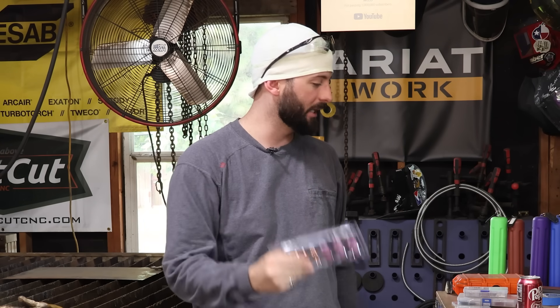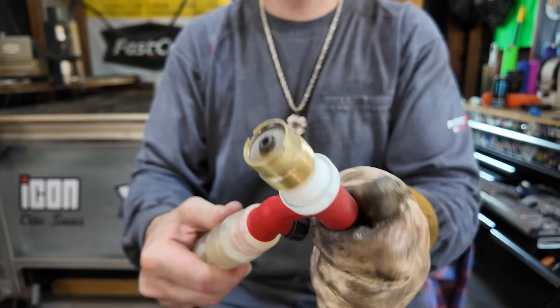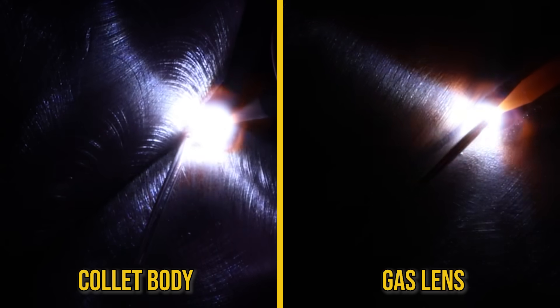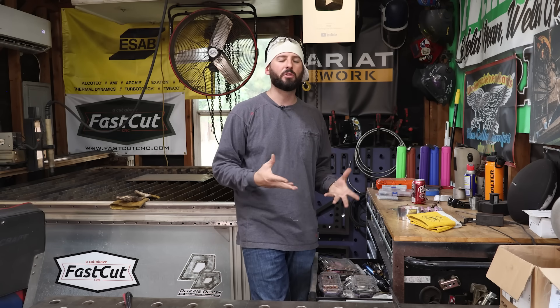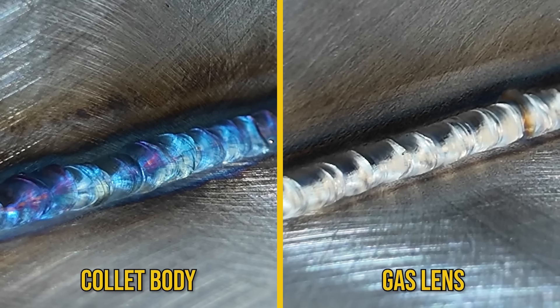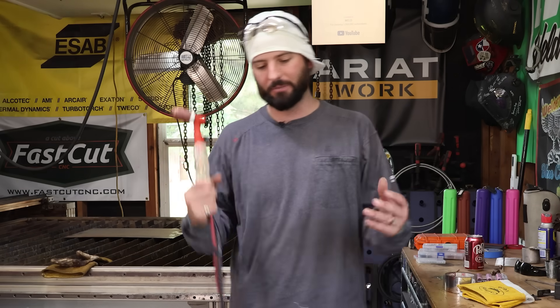You can be a good welder with just the basic setup. However, switching over to a gas lens setup is going to typically be better for you, especially when welding outside of carbon steel. Moving to stainless and titaniums, the more argon you'll need, so a bigger gas lens is nicer. With a collet body style you'll see a little flutter at the end of the arc — a slightly unstable arc — because the gas is concentrated and not well diffused. When you switch over to a large cup with screens that diffuse it better, you'll see a color difference and quality difference. On stainless steel it makes a real difference, but don't break the bank trying to set up your TIG rig.